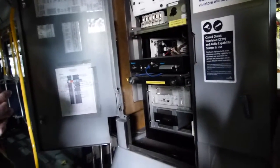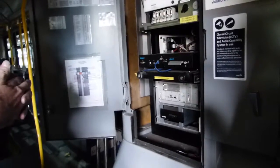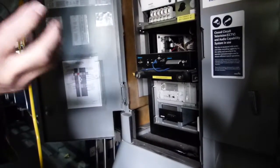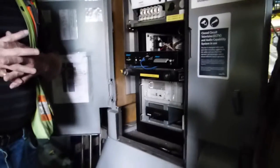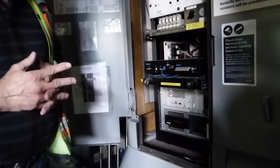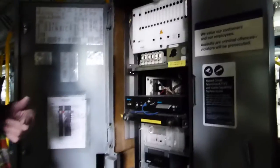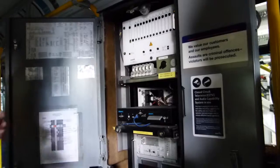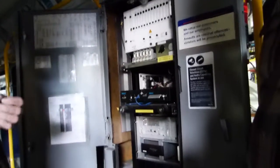Can't they just change the emitter/receiver and keep the fibers? Well, we're trying to maybe replace them, but the problem is they're no longer available — they're obsolete parts. That sounds counter-intuitive. It sounds like fiber optics would be the way to go for the future, but they're actually going back away from it now, back to directly connected wire — the CAN bus. It's all CAN bus, and it's more reliable on a day-to-day basis.